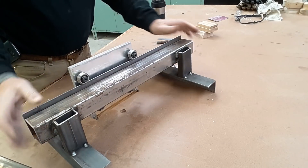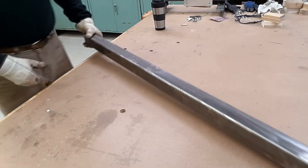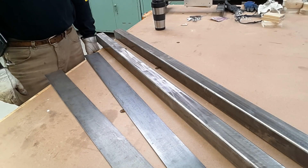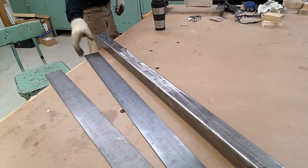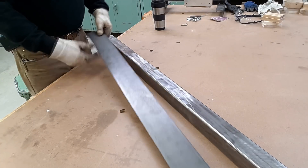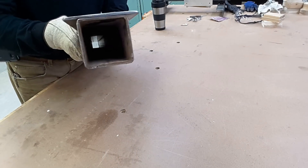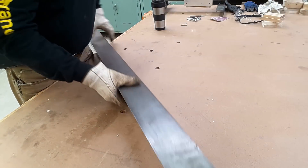So there's the linear rail design I'm going to go with, and this is actually my x-axis carriage now. Let's move on to actually making the two rails for the y-axis. Here's the stock I'm going to use: two pieces of two inch box tubing and two pieces of eighth inch hot roll flat stock.